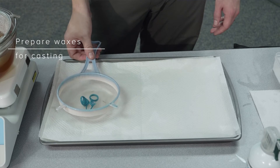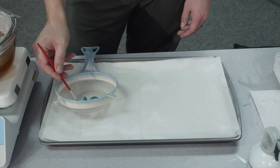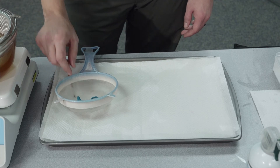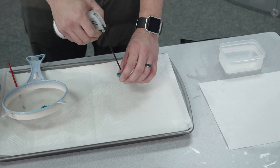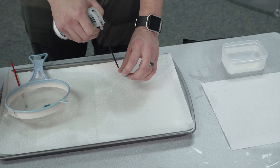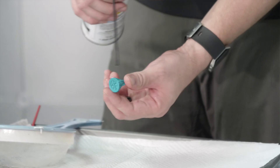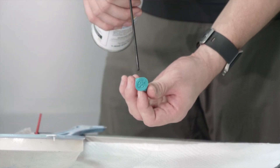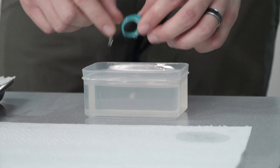Make sure not to heat up the VSO to more than 55 degrees Celsius. When you're satisfied that your models are de-waxed enough, carefully remove them from the bath. We recommend using a paintbrush to clean the models of any debris, especially if you're using older VSO. Next, carefully blow the wax with compressed air to remove further debris. It is also important to completely remove all the VSO. Finally, SolidScape recommends brushing or dipping wax with a light viscosity mineral oil.